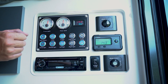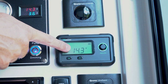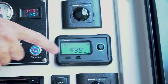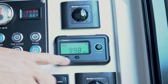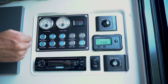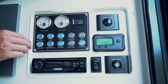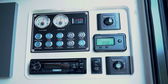Below that we've got our Renogy lithium controller. It's going to give you the ins and outs of your lithium batteries. You can see on the screen it's currently at 14.3, which is going to directly represent the gauge up here. Down in the bottom right-hand corner we have SOC — that stands for state of charge. That's the most important screen this display can show you. If it's at 99.8, it's pretty much fully charged. At 50% we're obviously half flat, 30% more than half flat, etc. When it gets down to about 10, the battery systems are going to go into protection mode and turn off.